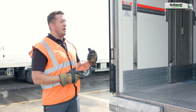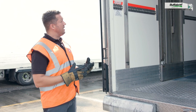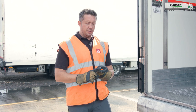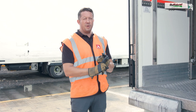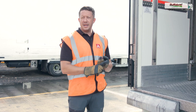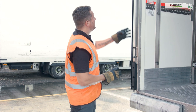We've already seen how to operate and raise and lower the deck outside the trailer — that's your first point of call as a driver. However, if that doesn't work, then you have more buttons that you can use. These buttons are at the rear of the trailer, but most of the time your trailer is going to be on a bay and you won't be able to get access to them. So you have two options: you can ask to go inside the distribution centre warehouse with a member of staff and try the buttons on the rear of the trailer, or you can ask them to close the bay, wait for the green lights, collect your keys and pull the trailer forward so that you can gain access yourself to the buttons.